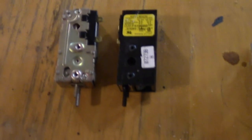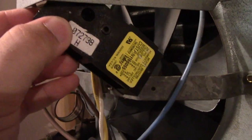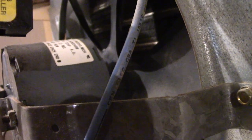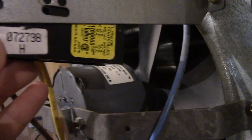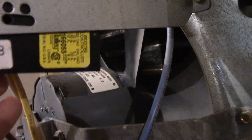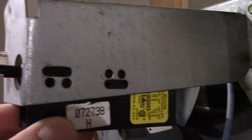So what I'm going to do now is attach this one to the bracket and see how it goes. Hopefully everything will work okay. I just tested it on here — if I put both the screw holes in the bottom slot, as you can see, that thing is pretty much centered through the hole. So this bracket's going to do just fine. If I put this new humidistat on these bottom holes here, that's going to work perfectly. Looking at that, it is perfectly centered. I really like how that works. So let me get the humidistat screws and put them right in that spot.